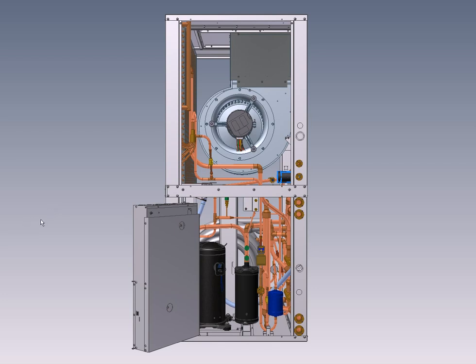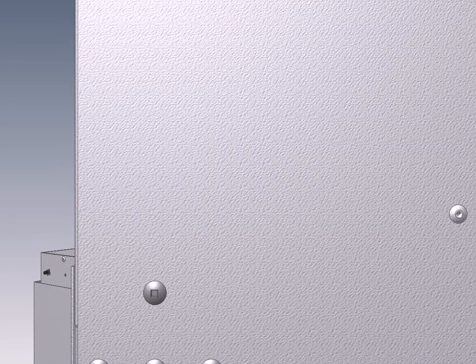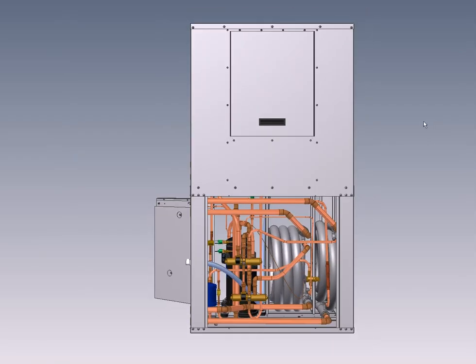There are some other line components worth mentioning — they might sound familiar to those who work with geothermal heat pumps. There's a balanced port TXV to control superheat regardless of operating conditions. It's got a reversing valve to provide heating or cooling, and a second similar valve to select air or water heat.